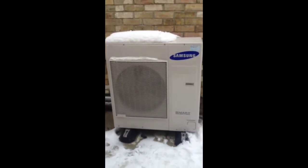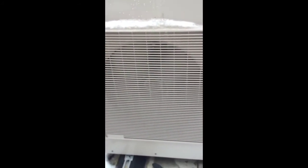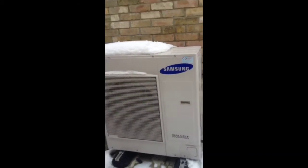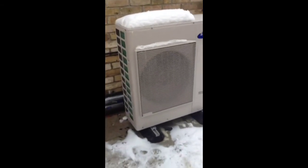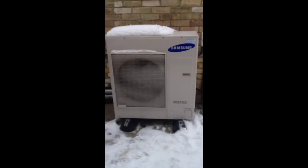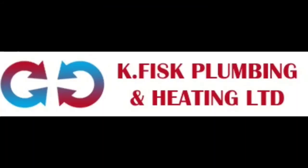So there's your little nine kilowatt unit. You can probably hear the noise it's creating, which you've got to admit is quite minimal. And obviously any problems, the first thing to do is check your fault codes. E911 will be mostly the one that comes up. Check your flow gauges, check your pump sizes, and don't forget to just bleed some air out of this top pipe there. So hopefully that helps a lot of the installers out there and it'll take a little bit of grief away from Samsung.